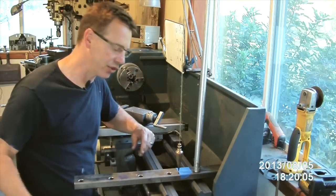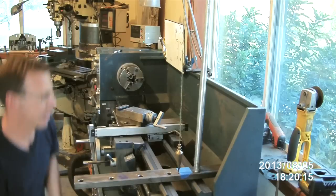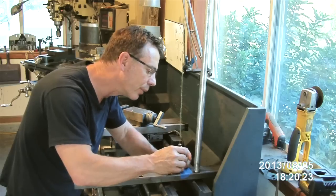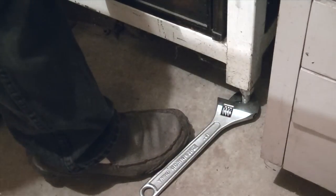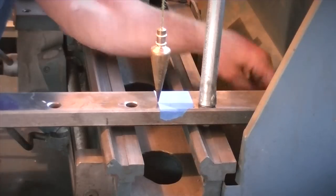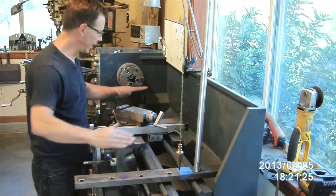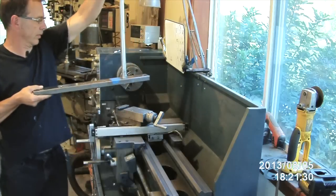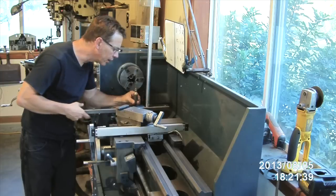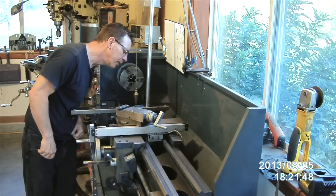So what I'm going to do is take my handy wrench, take it down to the floor on this corner. I've got the wrench right down at my feet and I can actually just move it with my feet, moving it over until everything lines up. That's looking maybe just a little bit more — steady the plumb bob. Perfect. Now what happens is we've lifted this corner up, so now we have to check the other side. We need to line up to our marks — just here and here. Perfect.